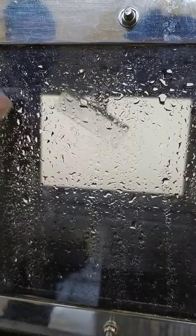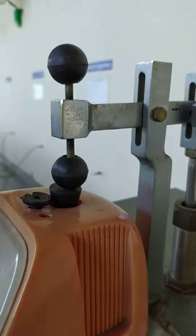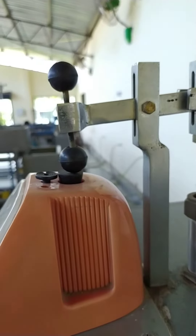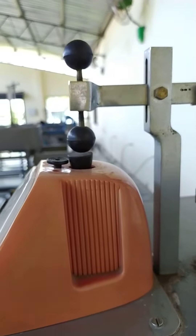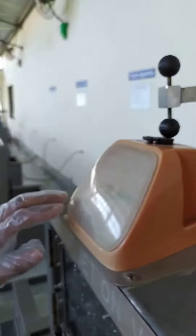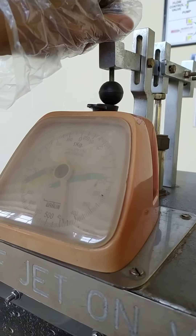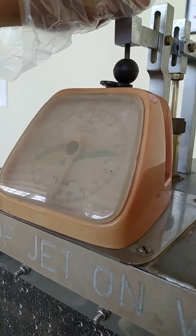The lower part is the jet and then the vanes. With the water spraying through the vanes, you can see a difference. The moment will cause the dial to displace. This displacement will be noted. As you increase the pressure, the dial reading will increase.